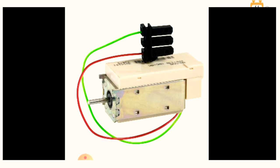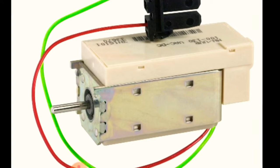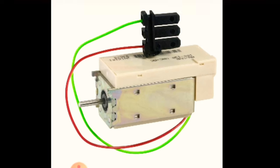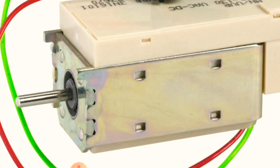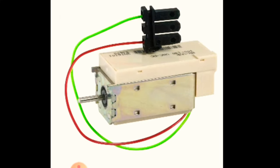Now I will show you first what accessories are used in this breaker. Here you see first, this is MN or UVR. As it is written here, MN UVR. This is under voltage relay. So first you have to see, after that I will explain the function. If you see this lever which is coming out, this is MN. How the MN works I will explain to you.